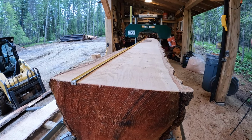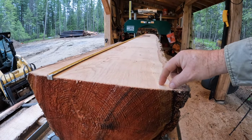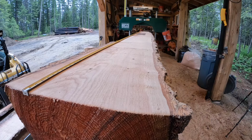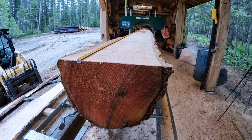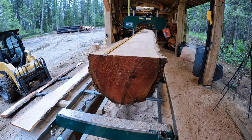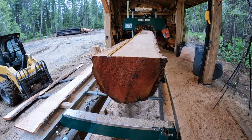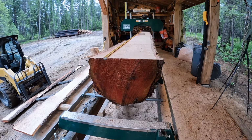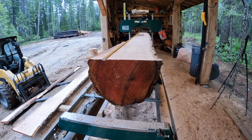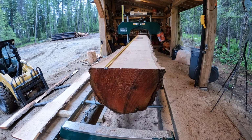Also, people think about heartwood versus sapwood. You can see this white ribbon there. That's the sapwood. It'd be best if the whole beam was heartwood, but all these beams are oversized. The 6x10 that's spanning 12 feet is plenty of a beam there. I know it ties the whole structure in, so anyway, I'm not going to worry about it.